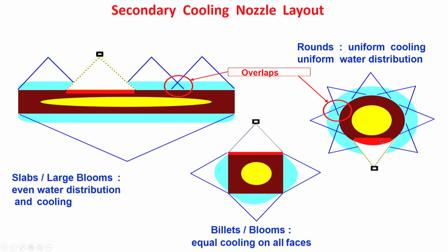So, what is the problem? Here, as I have told you, there is a possibility of tensile stress formation or strain formation. So, there is a possibility of reheating crack in these areas. Why is the temperature more here? Because inside temperature is high, because it is molten steel. It is getting properly cooled in other areas, so the temperature of the shell is less.